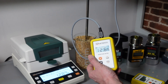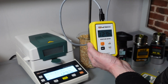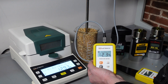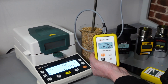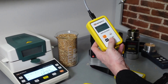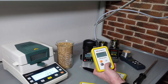Model M150GL has a longer rod and M150G has a shorter rod. Their sensors are absolutely identical. So let's select wheat and stick the rod inside our sample. We got 12.7, 12.6, 12.8, 12.7 on average. Note that at the bottom the sensor will feel the table and our glass, so we don't measure at the bottom.